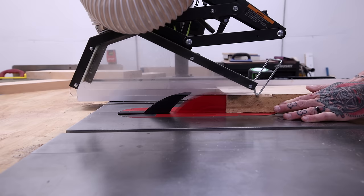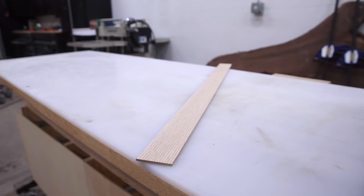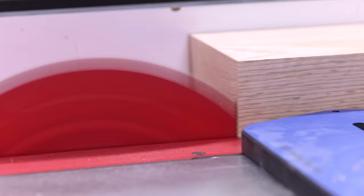I think the main reason my past attempts at steam bending didn't go so well is that I tried to bend kiln-dried walnut that was almost an inch thick. So this time I'm going to cut every piece to an eighth-of-an-inch strip. This makes steam bending easier given how flexible the wood is when cut that thin, and also allows me to create a really interesting finger joint using those bent wood strips.